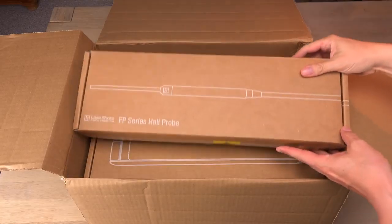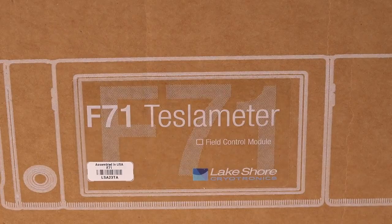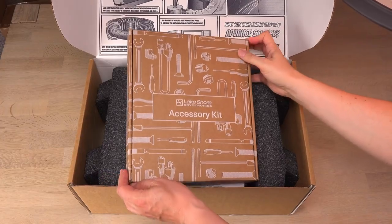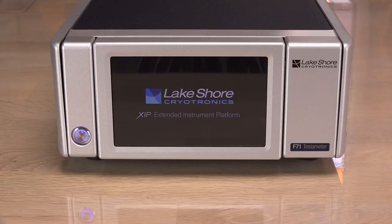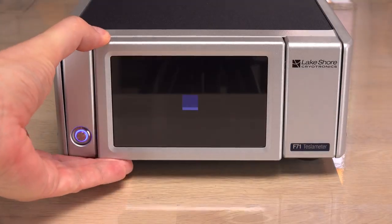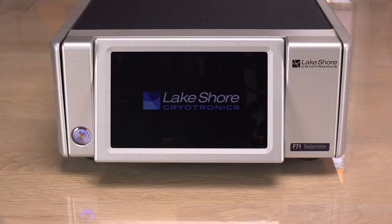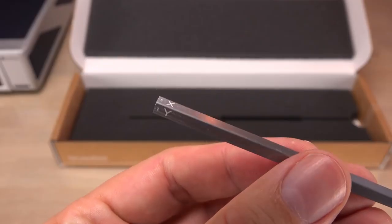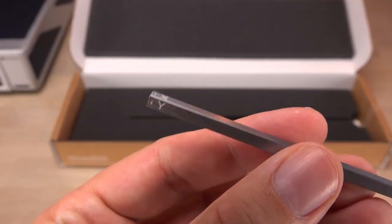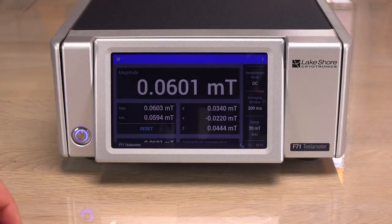Let's get more scientific and use a lab instrument that can show us the direction and also the strength of the magnetic field with high precision. Not an easy task with a weak field, but this is where the big donation comes in. I'm so lucky that one of my subscribers works at Lakeshore and their new F71 Tesla meter should meet my crazy needs. Not only does it measure at a very wide range of strengths using just one probe, it does so at three axes at the same time. Finally, I can measure in the three-dimensional world of magnetic fields.